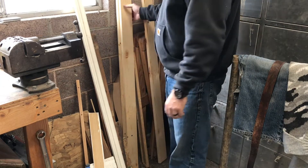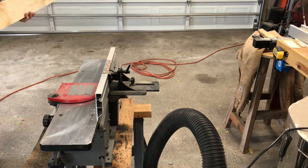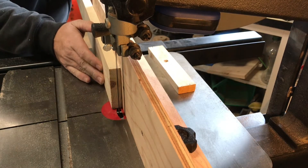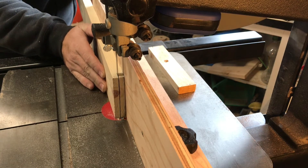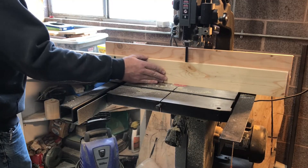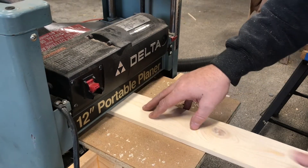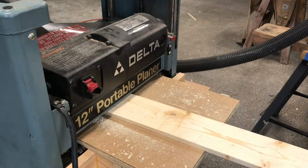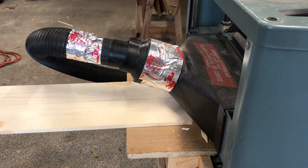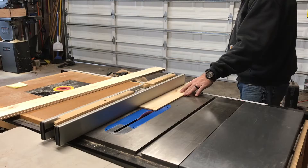So I'm making these boxes out of some scrap pine I had laying around — that's kind of my scrap pile there in the corner of the shop. First thing I do is run it through the joiner, joint one side, and then split these down the middle on the bandsaw — not exactly, but I eyeballed it, close to down the middle as I could get them. Then I run them through the thickness planer to get all four boards the same thickness, so the sides of the boxes are all the same. Smoothing them out, getting them the same size, and also making them flat and nice.